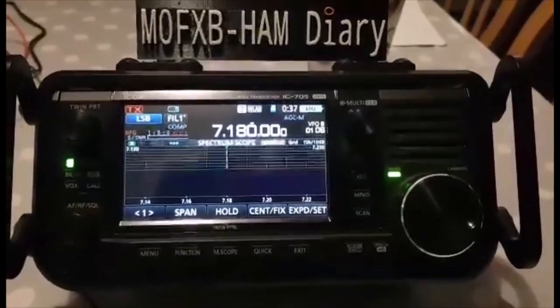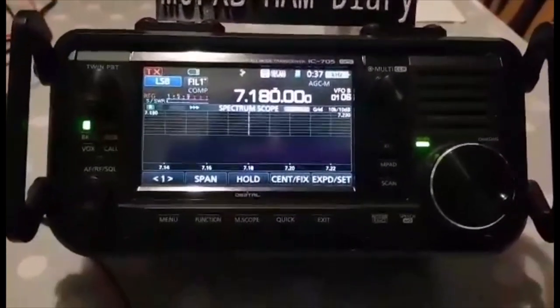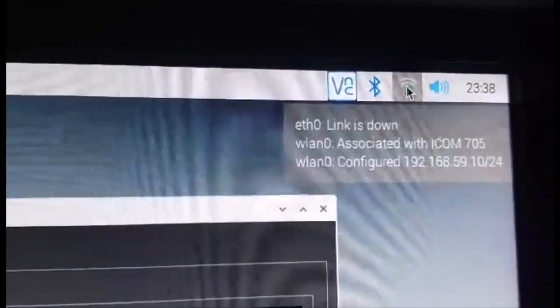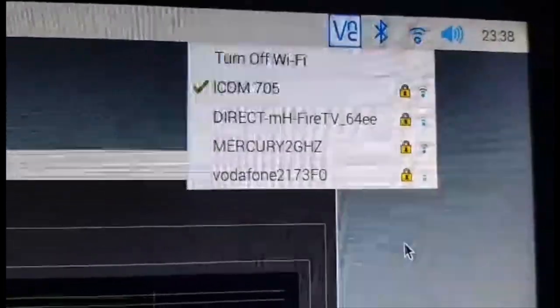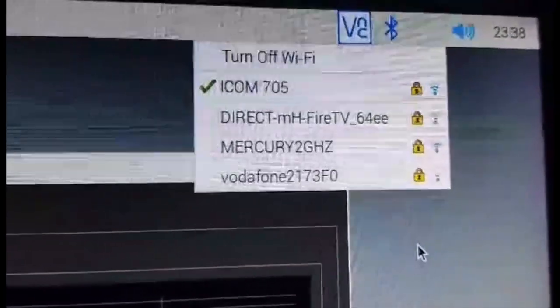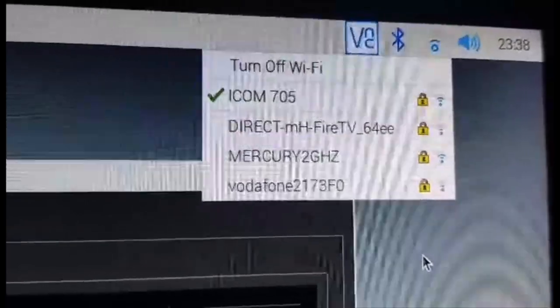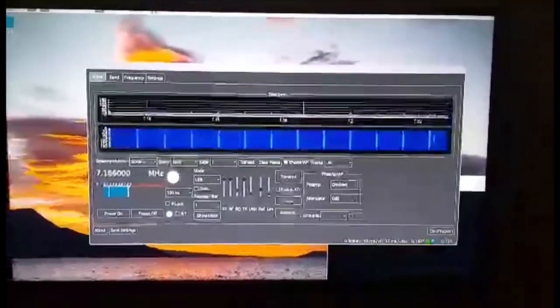It's really important that you connect your 705 access point to the Raspberry Pi. Go into the Raspberry Pi, look in the menu where it says Wi-Fi. Get your mouse up to the Wi-Fi section — that should be connected to your 705. I've named it '705' to find it easily. You don't want it connected to your router at home. The 705 is an access point, so it's allowing the Raspberry Pi to connect to the 705. Really important. So we've got it working, finally — a few more settings to do.